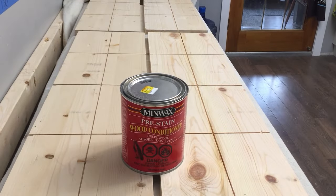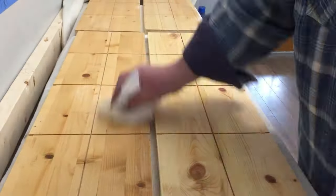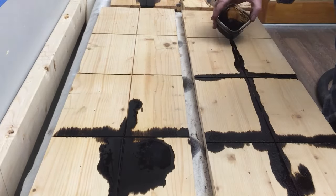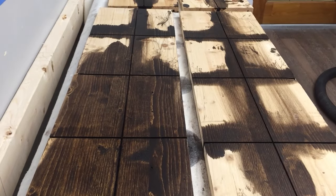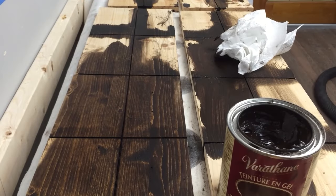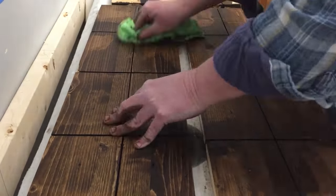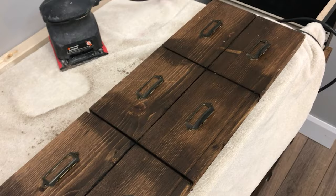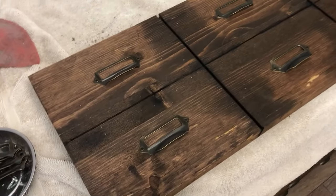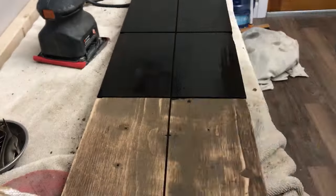This is the part of the project where the wheels really came off. My inability to do any fine finishing came through in spades. I coated the raw wood with pre-stain conditioner and then completely messed up everything else with the staining process. I had seen another YouTuber use a small dish with a hole poked in it to drip dark stain into the grooves, but the hole I made was obviously too big and the stain poured out everywhere. I tried covering the boards with a gel stain but the dark stain just leaked through. I originally planned to make all of the drawer fronts the same color, but once it was done I hated the look. I stripped off the hardware and sanded the drawer fronts back down, then reapplied different shades of stain in random patterns.